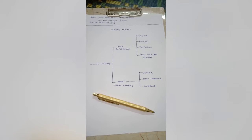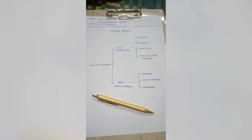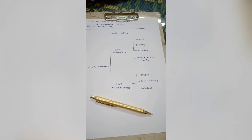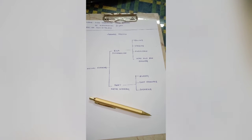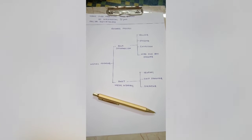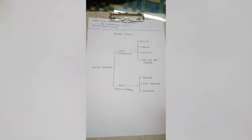Forming process is a mechanical process used in manufacturing industries wherein materials, mostly metals, undergo plastic deformations and acquire required shapes and sizes by application of suitable stresses such as compressive stress, tensile stress and shear stress. This metal forming is divided into two categories: one is bulk deformation and another is sheet metal working.